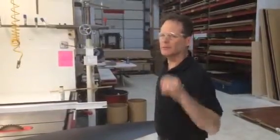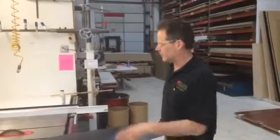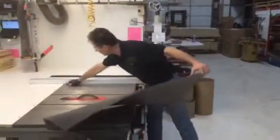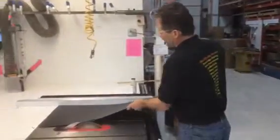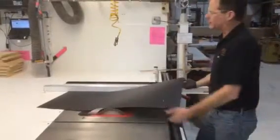I want to show you a couple things that I learned from a couple German cabinet makers when I was younger on cutting laminate. First of all, most table saw fences have a little bit of a gap underneath them — they're never perfect. And so what happens is if you're running a piece of laminate, which is very skinny, right up against the fence, what it wants to do is find its way underneath like that, and that makes for a very bad day for everybody.